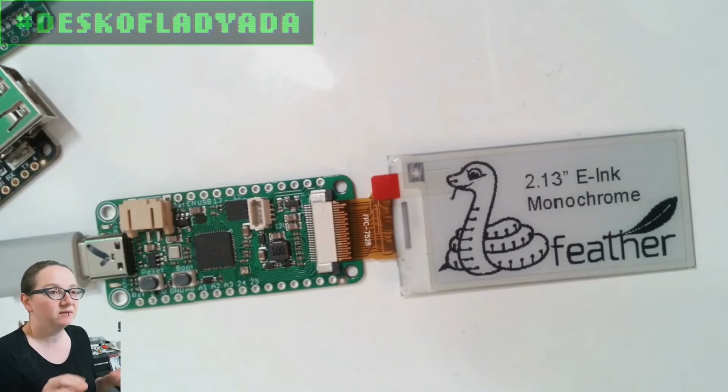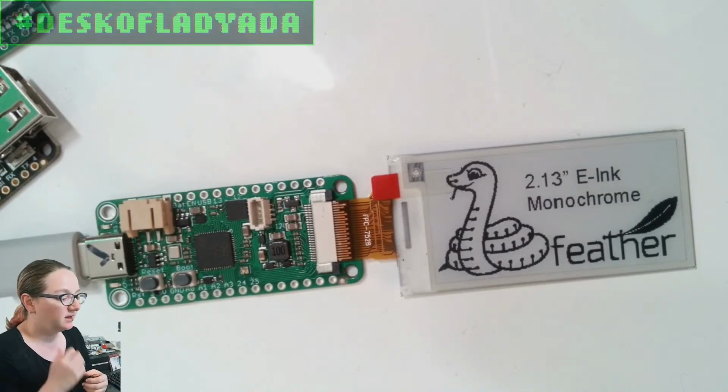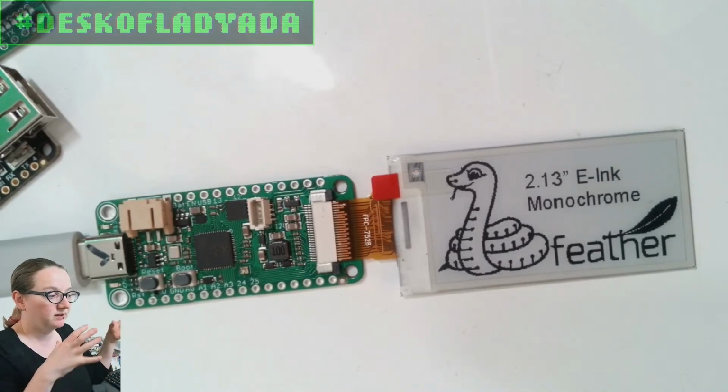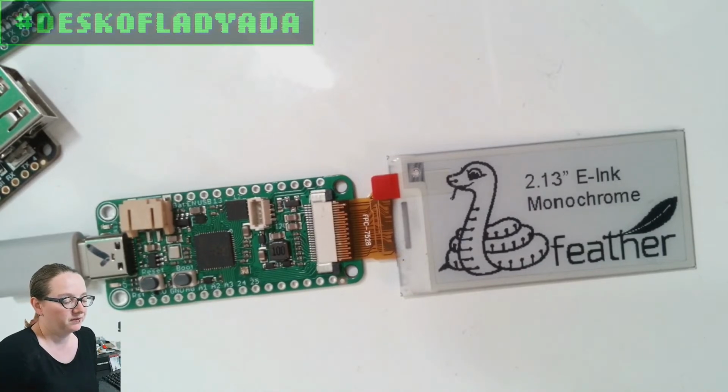And they were basically sensors that connected over USB. And there's something kind of nice about that, because you want to program something on your computer with Processing or Python, and you want to use your computer but connect to hardware. An Arduino can do that, but then you have to do this serial port communication thing. So some of the boards that we've sold that are really popular are the FT232H and MCP2221 modules.